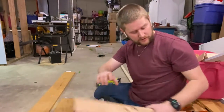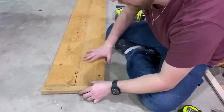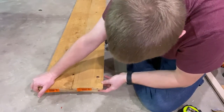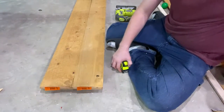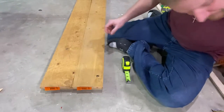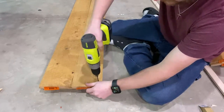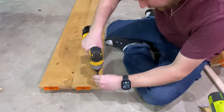I'm going to go ahead and screw them into the plank. Now that we have our posts all cut and ready to go, we're going to get them screwed in. We're not going to put the post right on top — instead we're going to come in about three quarters of an inch, which is the thickness of our wood. So we're going to measure in three quarters of an inch and put it right there. I get a drill and just pre-drill a hole through the first wood — this wood splits very easily. So I just go through it, take it out, then grab my screw and put it in.